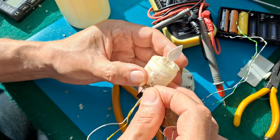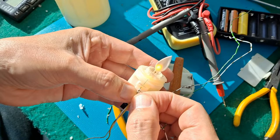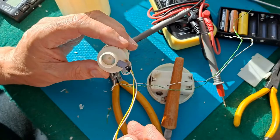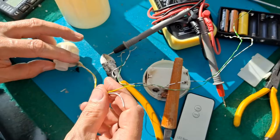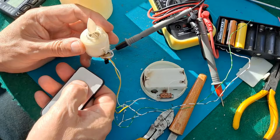If I connect power directly to the LED, get it the right way around - I think we can see clearly enough the LED is coming on. So the LED is okay. This is the infrared sensor for the remote control. So that's 3 volts onto there, and if we shine this on the sensor, nothing's happening.